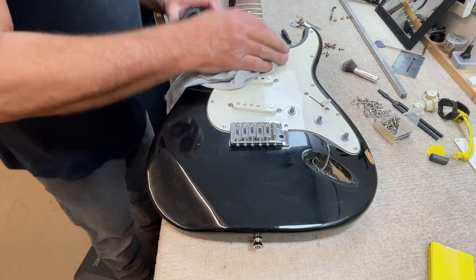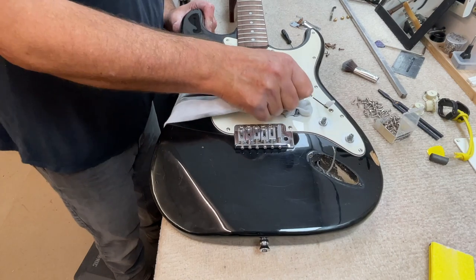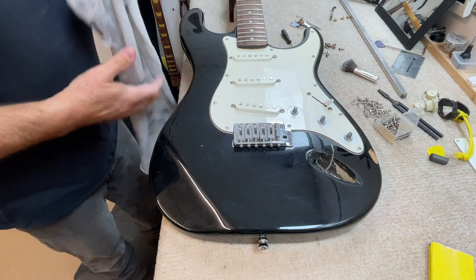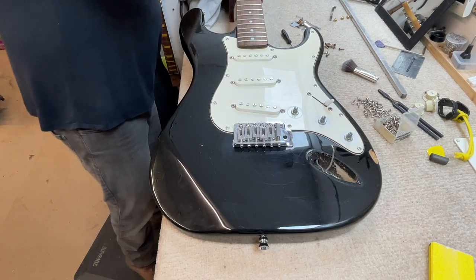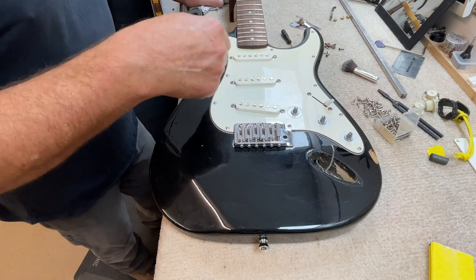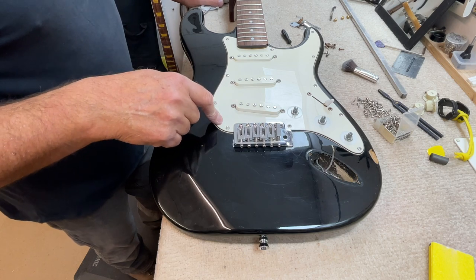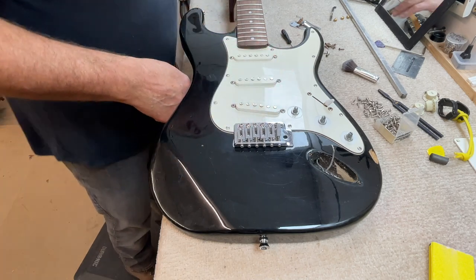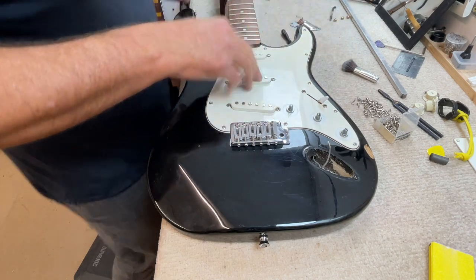Now, some of the older style pickups could slightly do that because they were what was called microphonic, but they were microphonic mainly because they were bad as electronic pickups, so they actually work better as microphones. Even if you had microphonic pickups in here, you could hit the strings all day and still not hear that wood sound get through into the amp, because it would be so small in relation to the electronic signal coming from the coil of wire.